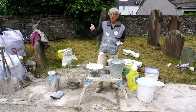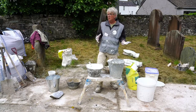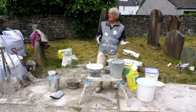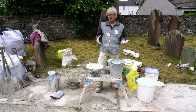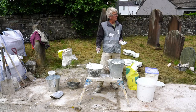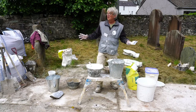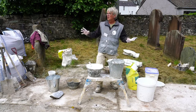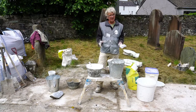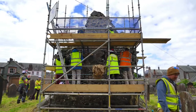In towns like this, in Scotland, in Wales, where did people still lime wash, or lime wash the longest? In the wettest parts of the country. And yet we're told that pure lime is not durable in these parts of the country. And yet most of the buildings are lime washed with pure lime, and it doesn't fall off, generally speaking. It doesn't suffer in frost. It's so capillary active that as soon as it gets wet, almost, it gets rid of that water very quickly.